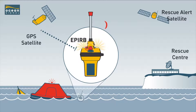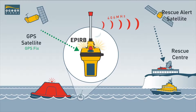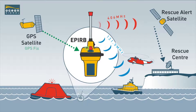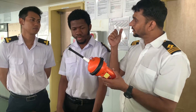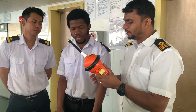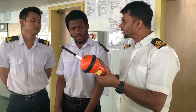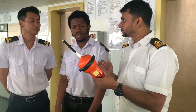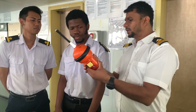From the satellite it will be transmitted back and relayed to the LES — Land Earth Station, the coast station. This coast station will know which ship this EPIRB belongs to, because each EPIRB is registered to a specific ship, like an identity card. The same way a car registration number identifies the owner, the EPIRB has a specific code registered to a particular ship. Once the signal reaches the coast station, they know from which ship it is coming.